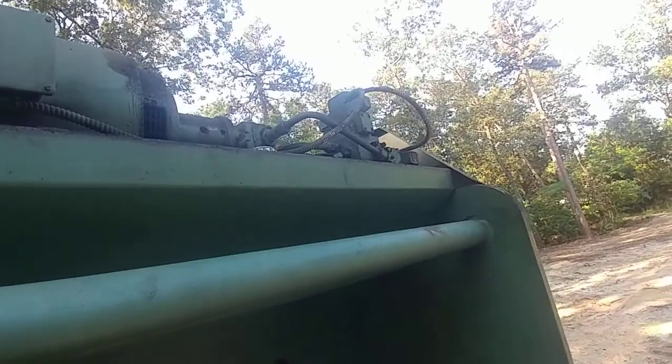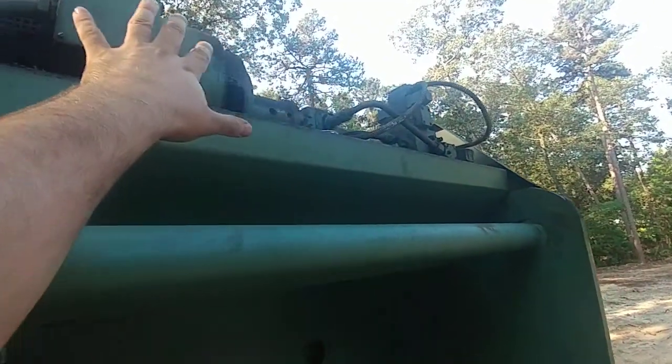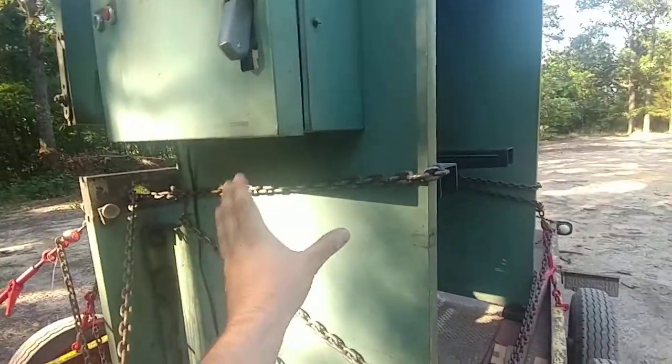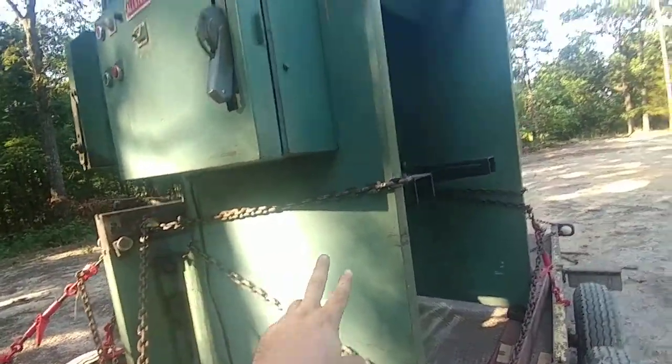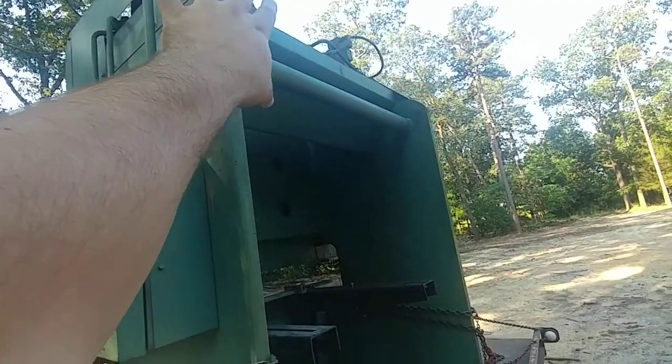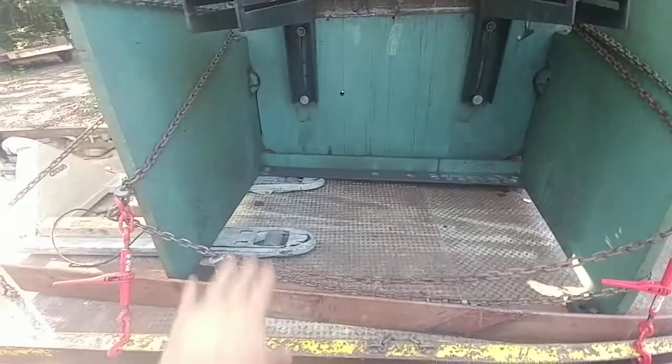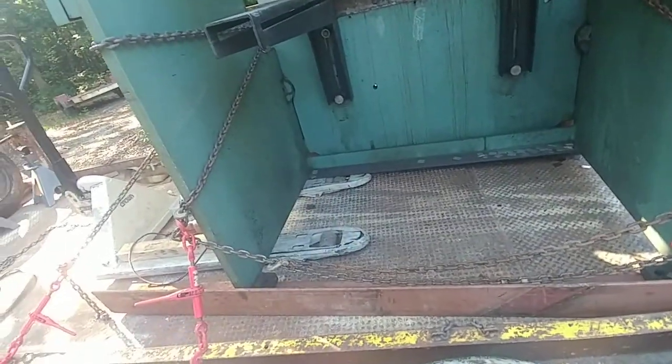which leaves me the problem of having hydraulic power, which again, I'll replace all of this with something that I can do what I need with. So I'll end up mounting probably a VFD somewhere and running wires from the VFD up to a motor. And I'm really not sure where I'm going to mount a motor yet. I may even mount one down here and just run hydraulic lines up. Just something that I can easily get to.